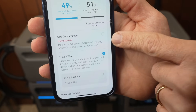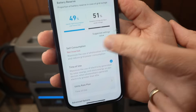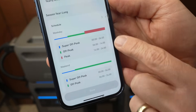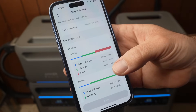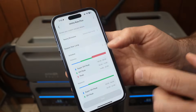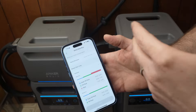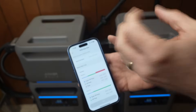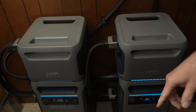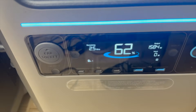Let's talk about time of use in the app. There's self-consumption mode and time of use — I have it on time of use right now. I have this set to 51% conserved for a power outage, and 49% used for savings mode. Right now the batteries are at 63% each, and I have my rate plan set. In these sample settings, the peak time starts at 2 p.m. — it's 1:15 right now. At 2 o'clock, when electric rates are highest, the app tells the batteries to start producing so we can save money by using stored power rather than drawing from the grid. To speed up the demo, I changed the time of use to 1 o'clock and heard the relays click — it automatically started outputting power from the batteries to cover electricity that would have come from the grid.